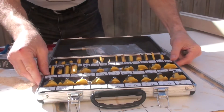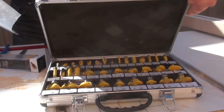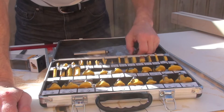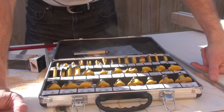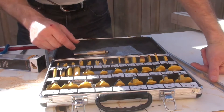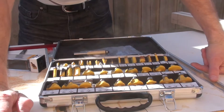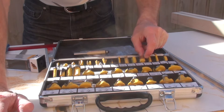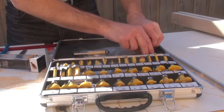Just so you know what's going on — this is a set of really cheap Chinese router bits that I bought when I first bought my router because I had no idea how to route, what bits I needed, or how it all worked. It's been really good for letting me know what pieces I need for the kind of work I do. But the bits are terrible — they dull very quickly and I get chips out of the blades really quickly. This one was only used to cut pine plywood and it got hot and chipped quite a few of them.